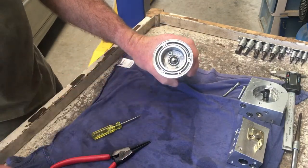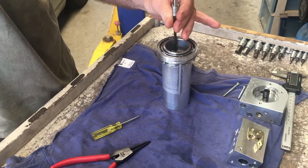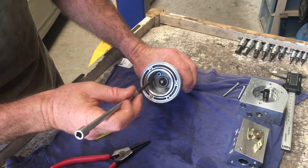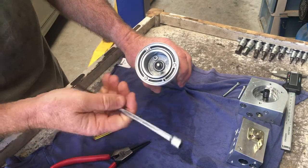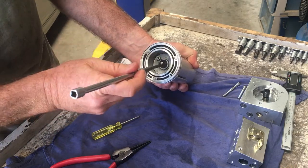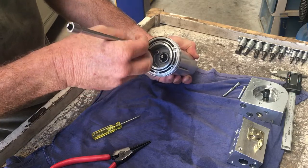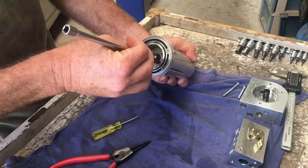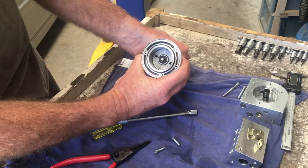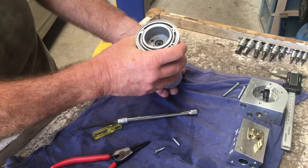As you're actually loosening this, the motor will actually just fall straight down. Before I actually do that, you'll notice that there's a seal on the inside here because all this is going to be full of fluid normally. That seal — it's kind of like a really small version of a crankshaft seal. So it's basically a large sort of metal-backed type thing which has got a spring around it, so it's going to hold tightly against the shaft. If you've got leaks going into the motor, then you could replace that. But when you're actually putting this in and out — because now that's just going to fall straight out — you can actually see as you push that in there if it's actually going there and sealing nicely against it, and you'll be able to work out whether or not that actually needs to be replaced. It looks like it's in pretty good condition.